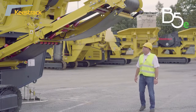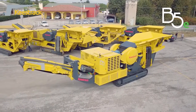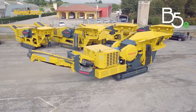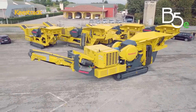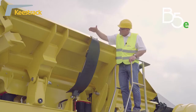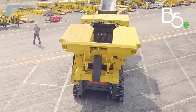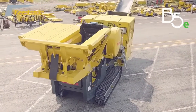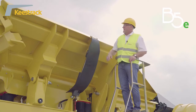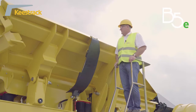Keestrack is presenting the Crawler Mobile Jaw Crusher type B5e for quarry applications, primary crushing, and for recycling applications for feed size up to 600 millimeter. So the hopper itself is made in double shell design, which means the outer shell is made of high tensile steel, one through-going element over the whole length, and also here one element through-going to avoid cracks here. And the inner shell is made of hardness Brinell steel 450.